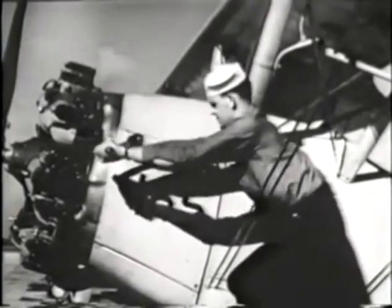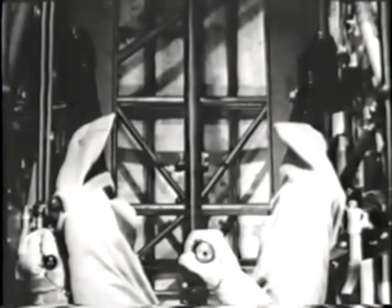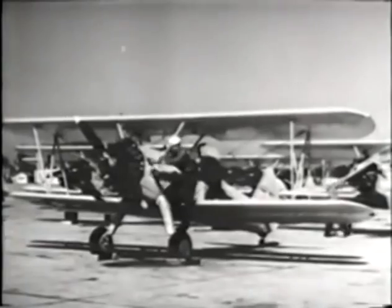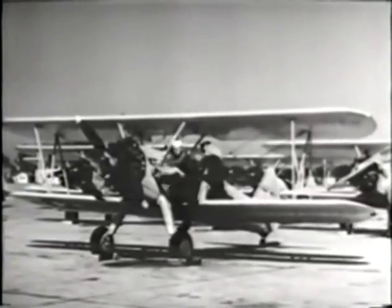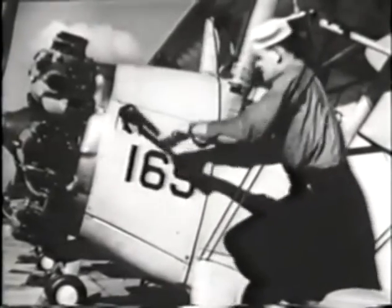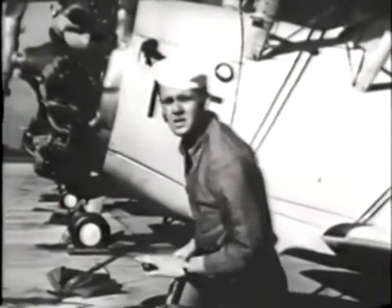While he's cranking it, hold the brake. This you do by pushing into your toes on the top of the rudder pedal. Holding the brake keeps the plane from rocking back and forth while cranking, and thus makes the plane captain's job easier and safer. When the inertia starting mechanism is turning over at a good rate, the plane captain will stand clear of the propeller and challenge you.